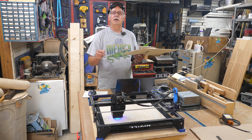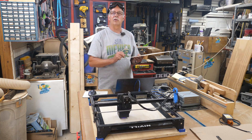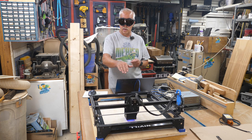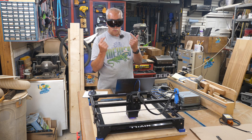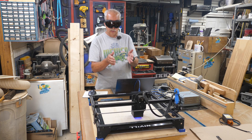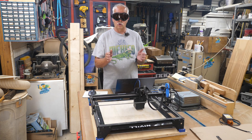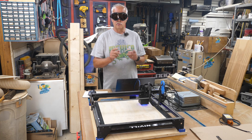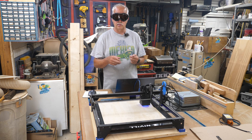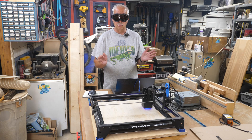I have 16 lasers but I'm not going to run this on all 16 of them. A little public service announcement: if you are looking at the laser beam, even though it has a shield on the laser head, make sure you wear your protective eyewear. Although the shield keeps the majority of light away, if you're going to be staring at it, always wear these. Also, if you are doing a mirror or glass, always wear eye protection — the light that refracts goes all over the place and can damage your eyes. These are made by Cloudray — not sponsored, I bought these.